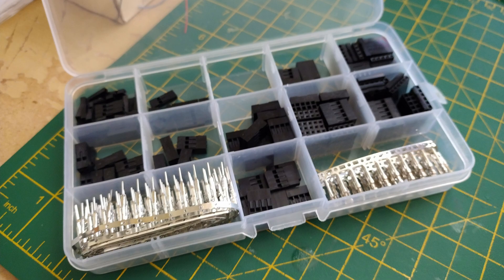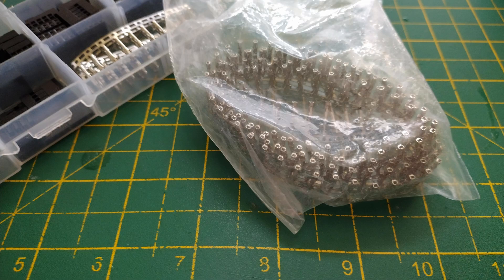I like to use connectors rather than hard soldering — it makes troubleshooting easier. I would just say go and get yourself one of these little Dupont connector sets. Most of the connectors you won't use, and as you can see in the top middle there, I've run out of three pins. The silver things on the left are the male pins — you'll barely use them because the pins will be on the flight controller. The right hand side are the females that go into the Dupont cases, and you'll use a lot of them. Find a source of just reels of these so you can add more as you need them.